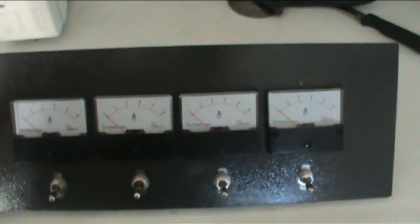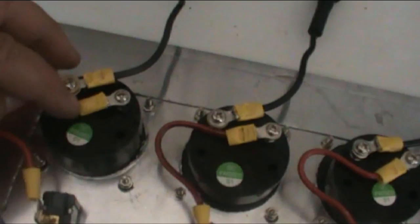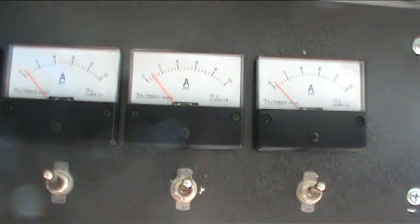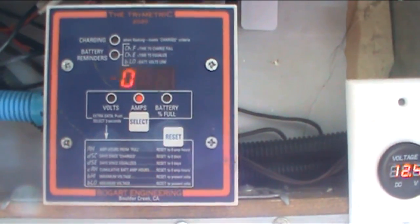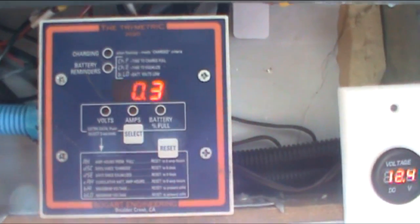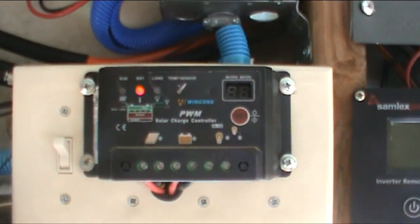Here's how the instrument panel turned out — pretty nice! I'm happy with it. Here's how it's looking from the back so far. I've got a fuse coming in, the positive part of the solar is going to come through here, going through the meter, down to the switch, and then this will continue to the controller. I think that's a pretty good place to leave off for now. Next video, we'll see that I blew out my solar controller and had to buy another one. Next week we'll be looking at the Sun Yoba 80-amp solar controller — a PWM — and a description of MPPT versus PWM controllers. Thanks for watching, hope to catch you next time. Have a good one.